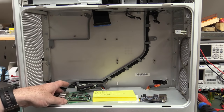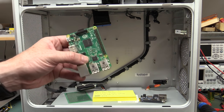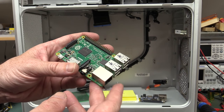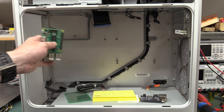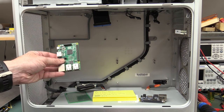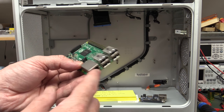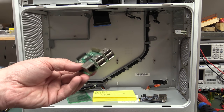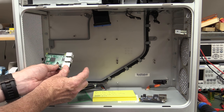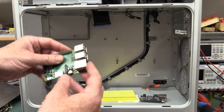Now, the one thing I haven't decided on yet is whether or not I'm going for the SPI solution that I figured last time and do my own SPI to Ethernet converter chip on there, because this case is all, you know, super high powerful, looks fancy pantsy. You've got this thing sitting there, it's got hundreds of ARM cores in it, and you get piddly little SPI bandwidth out of your Ethernet. So I'm tempted to maybe have a little short Ethernet jumper for each one, and then next to each one of the boards, just have the Ethernet cable coming out.